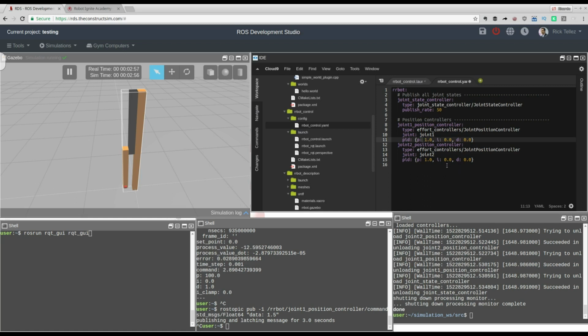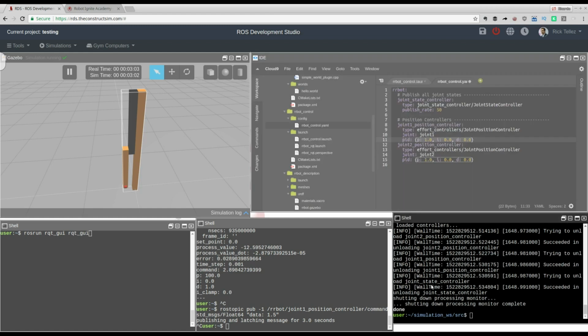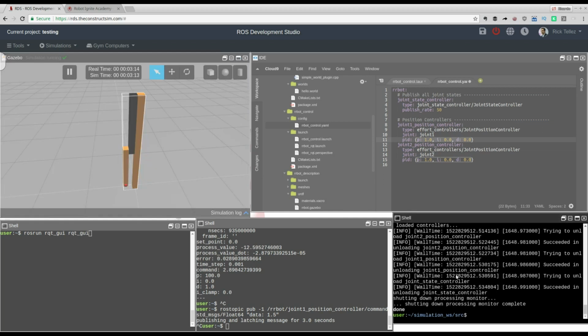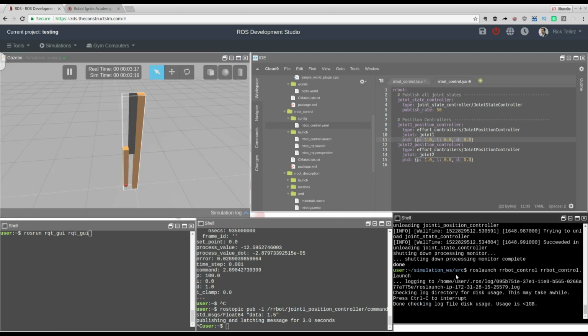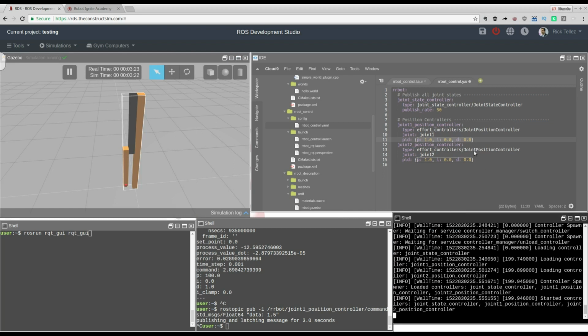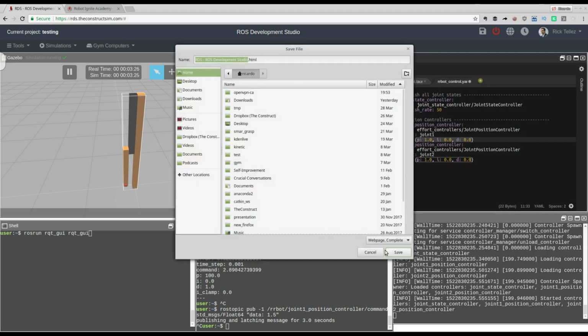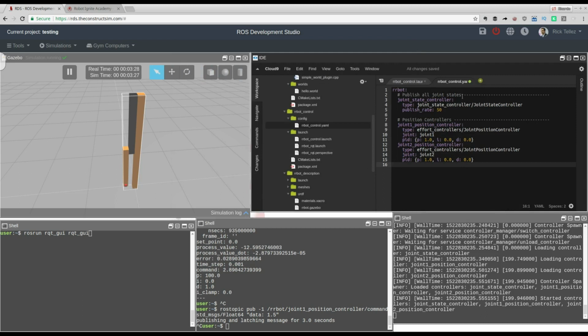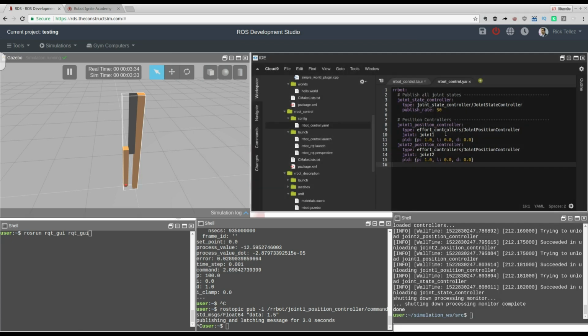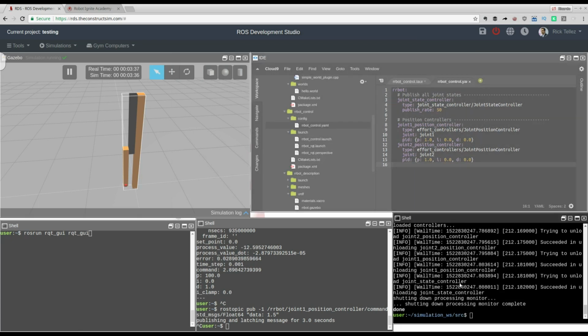So then let's go. We need to find those values. And for that, let me first launch the controllers of this robot, because as you have seen while I was starting, the robot was just swinging around because it had no control. I had to launch it. In my case, I haven't launched it with the simulation. So here it is, I'm launching it, and this is loading. Let me see, because I have here a dot indicating that something has been modified. So let me relaunch it again. I have saved this file, and let me relaunch the control.